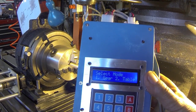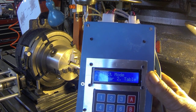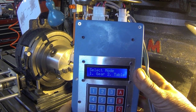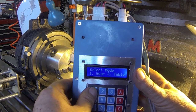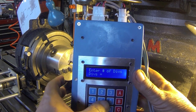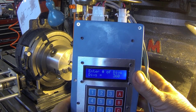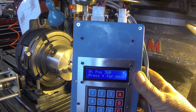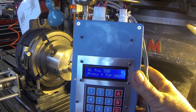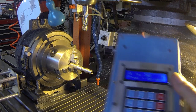What I want to do is set it for the gear mode, and I want to tell it the number of divisions. In this case, since I'm going to be stepping in one-degree increments, it's 360 degrees, and it's ready to go for the first position. Each time I press the star button, it'll increment one degree, so it's ready for me to cut.